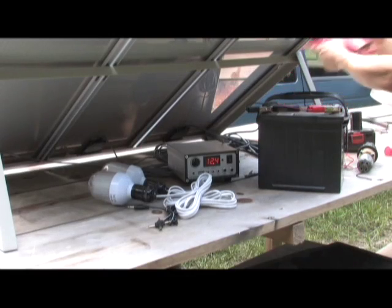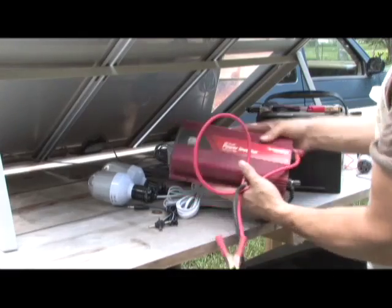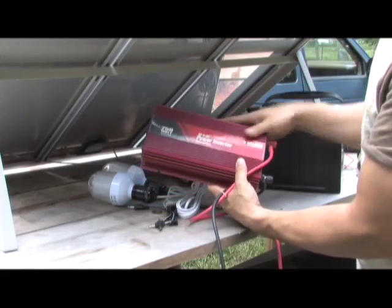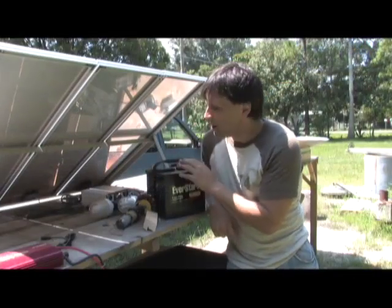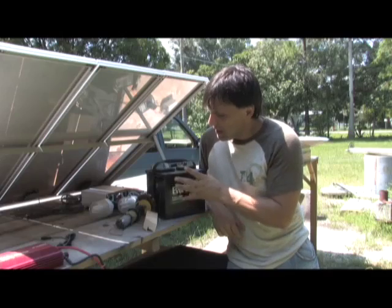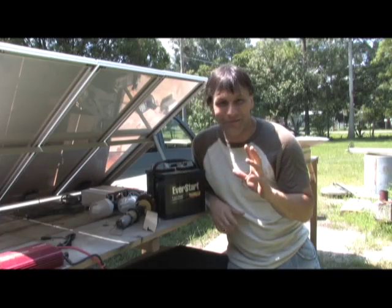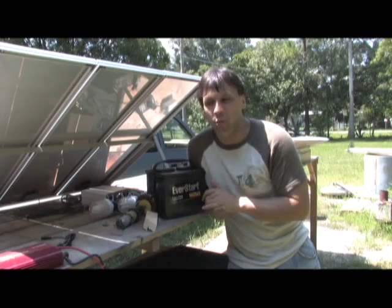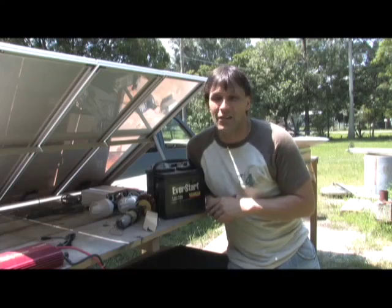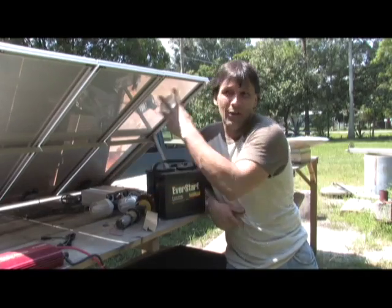At the end of the day, you can take an inverter like this one. The battery and the inverter didn't come with the kit. This is a 750 watt inverter that converts the 12 volt direct current into alternating current that you can use. It's worth noting that this 45 watt system is the equivalent of about 4.5 amps at 12 volts, so it's gonna take approximately 8 to 10 hours to charge up one of these batteries. You're probably gonna get about an hour to an hour and a half at 300 to 400 watts of usage. You would need several of these to do each individual task in your house, and that's why people who are totally off the grid with solar have several racks of these and their roof is covered with them.